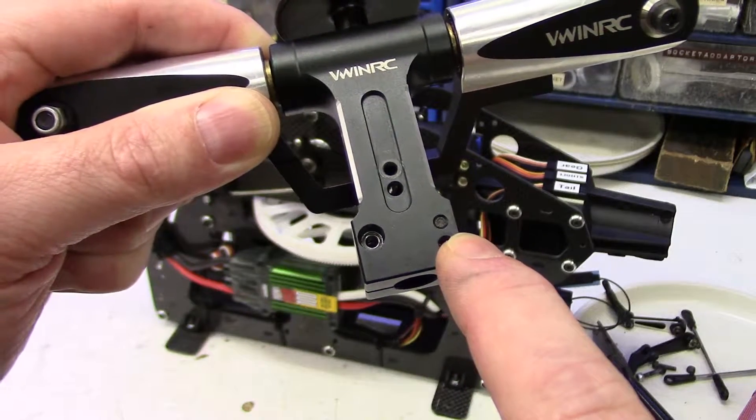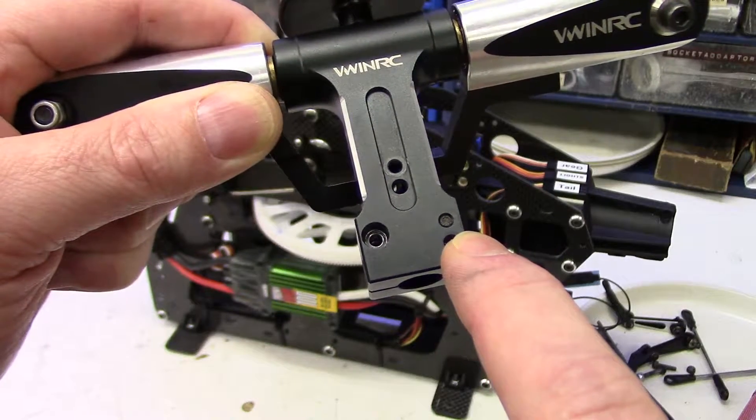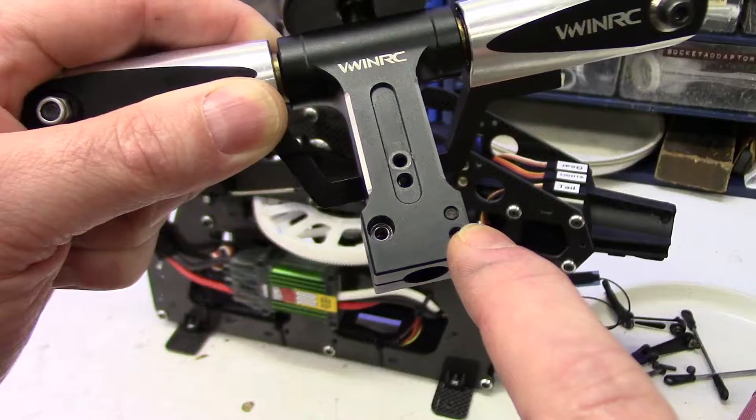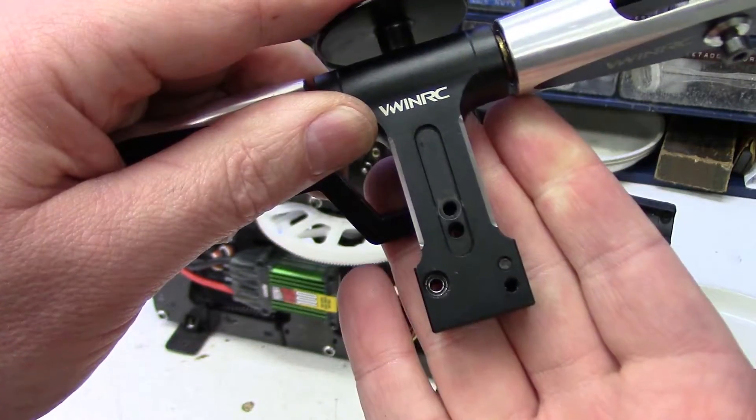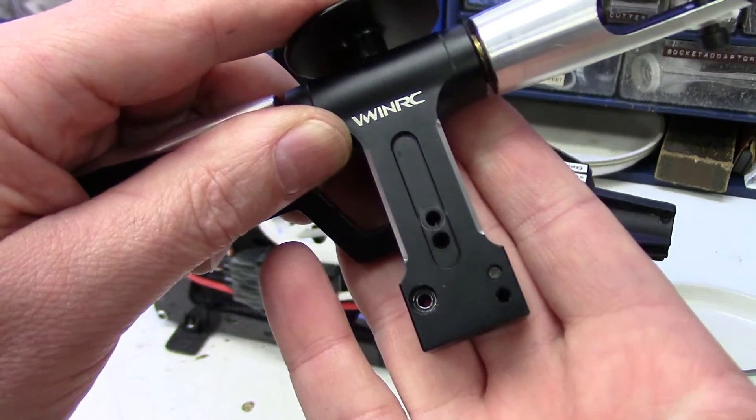If this gets really ugly, we're probably going to have to drill it right out and then re-tap the hole. We'll see where this goes. I'm just going to mount this in the drill press now and see if we can get that centering dimple in there.